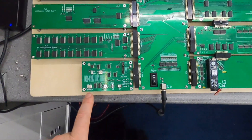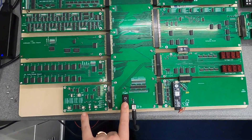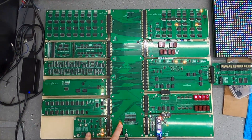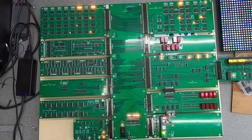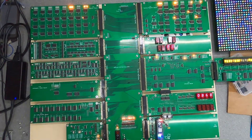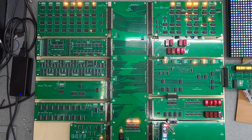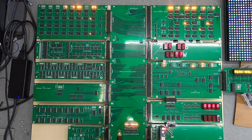The clock board is not the final board — there is a slight change needed for that. The key thing is our delay between the two clock cycles is now 200 nanoseconds rather than 250 from before. This is very important because it now means we can actually run at four MIPS.